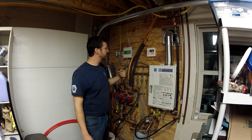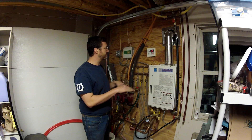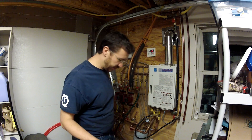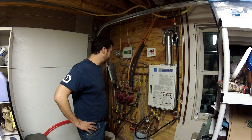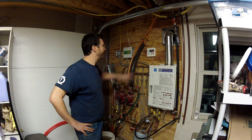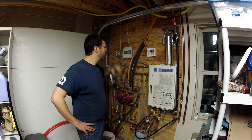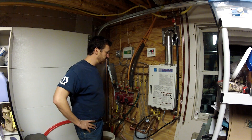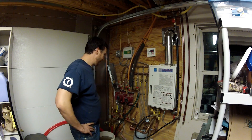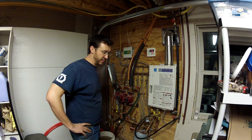The tankless is modulating down because the water coming in is hot, and eventually it should get to a point where it can't modulate any lower and it just cuts out. It's 108 coming in — when I went out there the boiler was off, so it's going to send pretty cold water initially. Now it's showing 111 coming in, out at 124, at 2.1 gallons per minute. I've been banking on this tankless shutting off when the inlet hits 120, but it's taking a long time, hovering around 110.